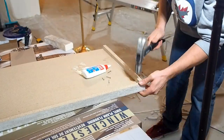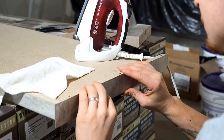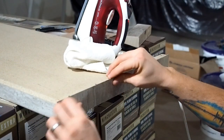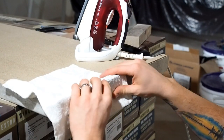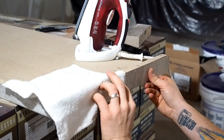Give that about 15 minutes to start setting up before moving to the next step. In the meantime, plug in your iron and let it heat up to its hottest setting. The reason I say hottest setting is because most modern irons don't actually get nearly as hot as the older flat-bottomed irons. You want your iron to be somewhere around 300 to 350 degrees Fahrenheit.